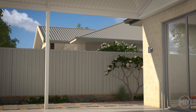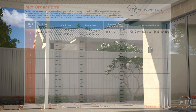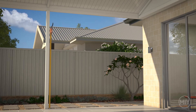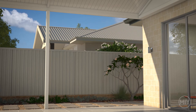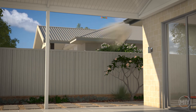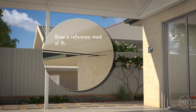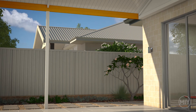Step 1: Mark the position of your blind. It is important to make sure your blind is installed level. Find the shortest side on your MIY order form — in this video, it is on the left-hand side. Measure from the ground up and draw a reference mark at this height. Using a string or laser measure, transfer this height to the opposite side, then mark the correct level. On most occasions, the patio beam is level and can be used as a reference point to mark the brackets to be installed level.